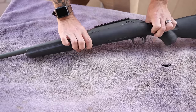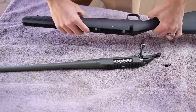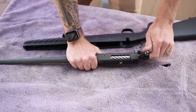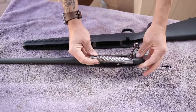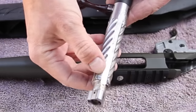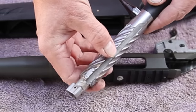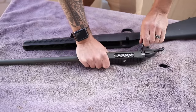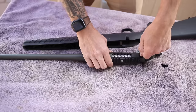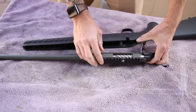I know this thing has the heart of a champion. It is a Ruger American Predator .308, and as you can see, it's missing the takedown screw — that's one of the reasons why he sold it to me so cheap. He also had some fun trying to mill out the bolt, and while it looks very cool, the milling machine might have gotten away from him and he had to patch this spot. That looks really ugly, and there's some discoloration from either the welder or rust. The bolt is also supposed to not come out unless you press this button, but if you just jiggle it, it will come out. So the bolt has some issues that we may or may not address.